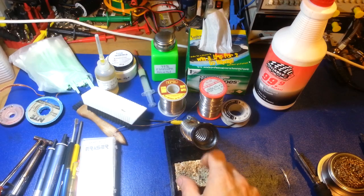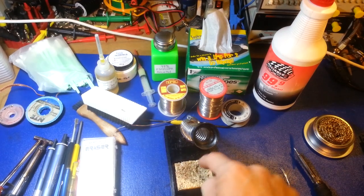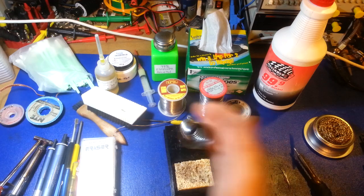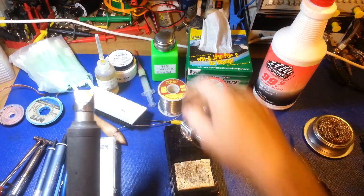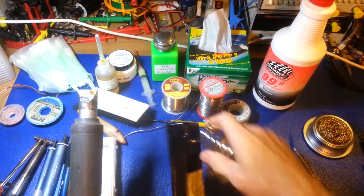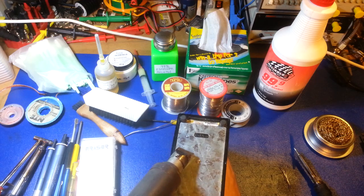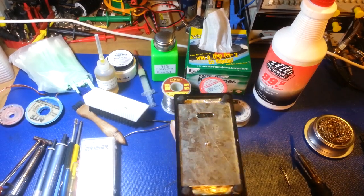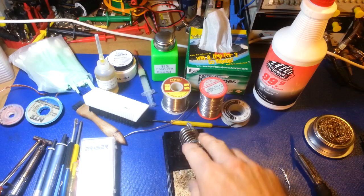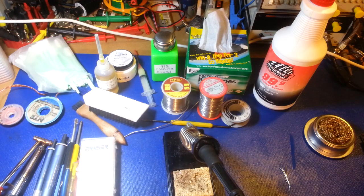I did that for a specific reason — for a long time I used the sponge holder to store stuff like wire and tip cleaners, and when I knocked it over everything fell out. I finally got fed up. I used the 300-watt American Beauty iron: I turned the stand upside down, laid a one-pound spool of solder in it, stuck the iron on top, and in about two seconds it melted a pound of solder into a molten pool. There's now about two and a half pounds of solder cast into the underside of that thing. It's so heavy it just doesn't go anywhere.